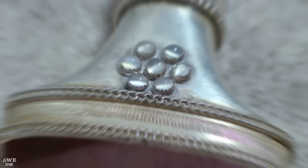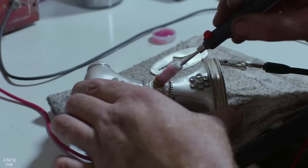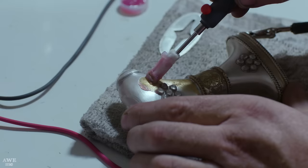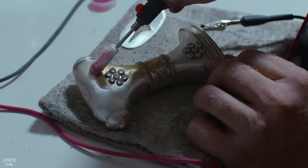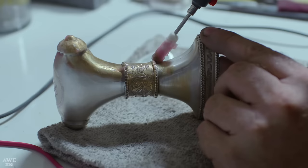We'll now be laying the gold permanently onto the surface using an electroplater. We've got a gel compound that has 24-karat gold in it, and the electroplater will permanently adhere the gold onto the surface. That's different from what would have been done in the past, where you would have used mercury and an amalgam and vapor, which is very dangerous.